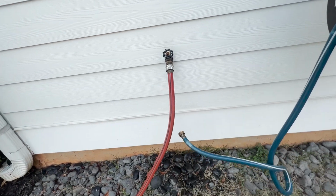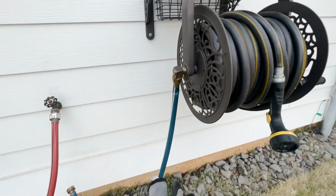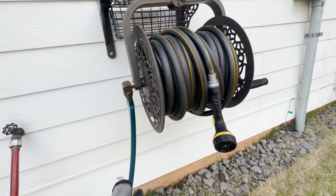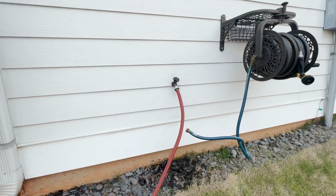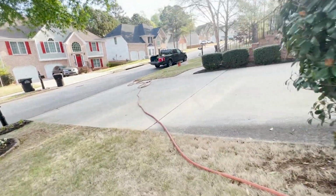And I never use the customer's hose, because one reason it may be hooked up to something like this, and the next thing, it could be small and it could starve your machine. You need to get a hose that allows a lot of water to come through. So make sure that you at least get a 3/4 inch hose so you can feed your pressure washer.